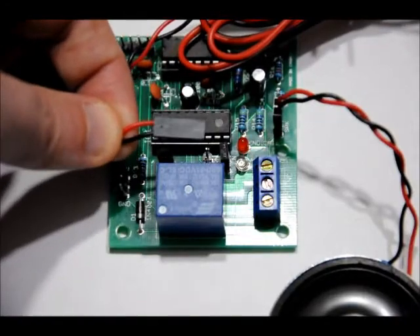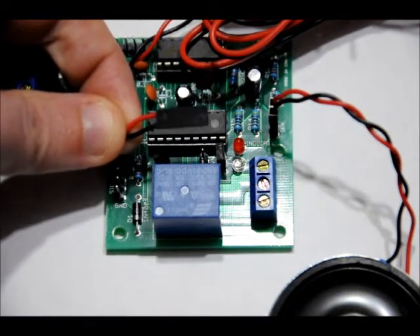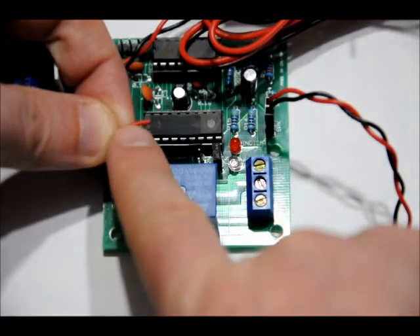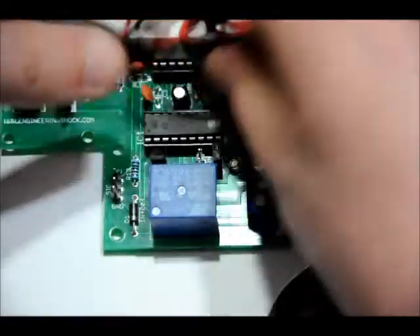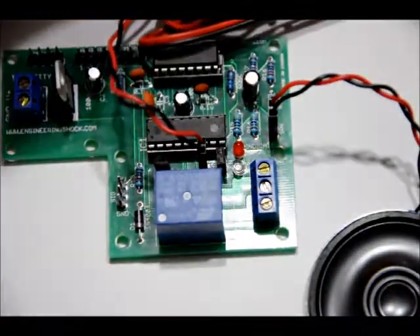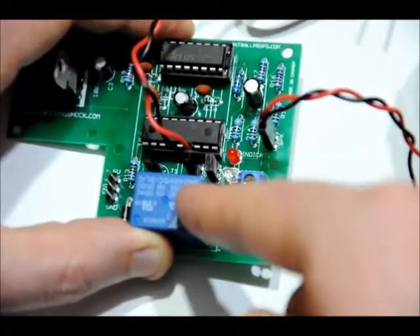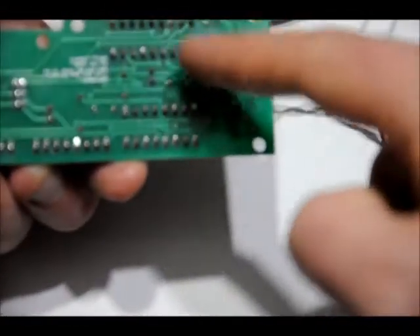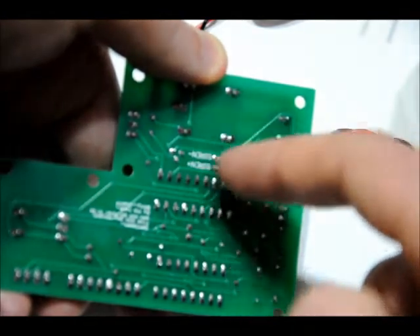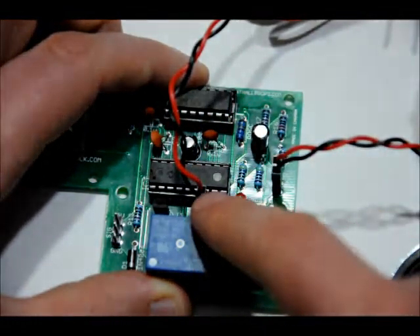The siren has a two-pin male connector similar to the speaker — red wire and black wire. The red wire is positive, the black wire is negative. The EN jumper is right here, and just to the left of it is the siren jumper. From this perspective, the red wire has to face the processor and the black wire has to face the relay. If you mix that up and the relay is activated, your device will reset and your siren could be damaged. On the bottom of the board, the header is labeled siren-plus for red and siren-minus for black. From the top, siren-plus is red, siren-minus is black.